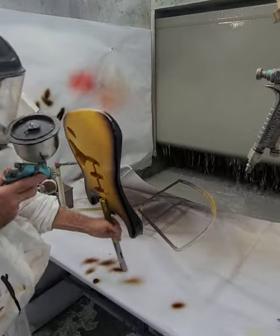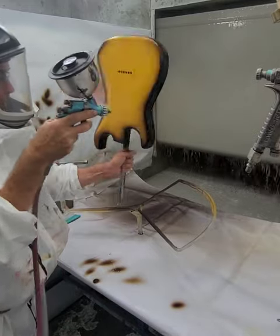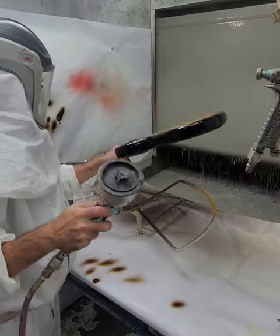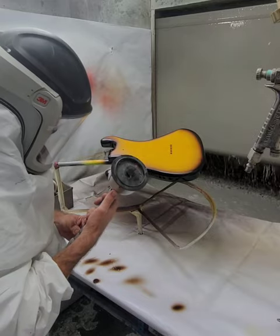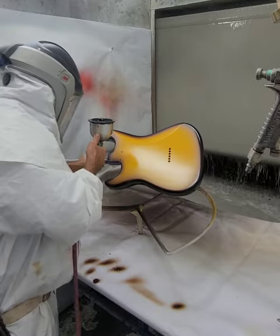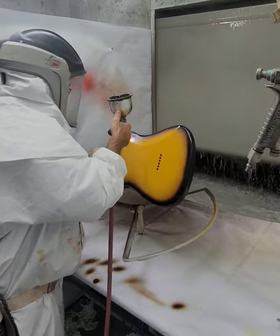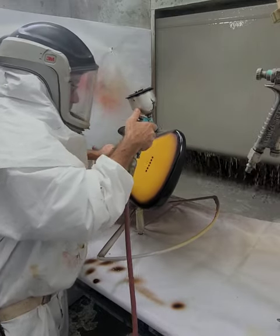I like to do the bottom like this. Now I'll turn my fan down to no fan — when you do that it seems to make the air pressure go up, so I'll turn that down. Then I'm going to do the burst. Regular three-tone sunburst — there's about one finger-width wide — so I'll just get a nice start here of the burst going.